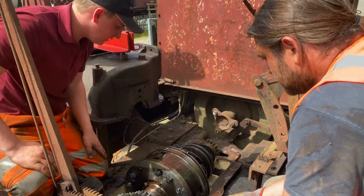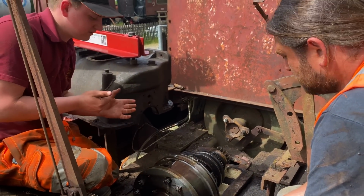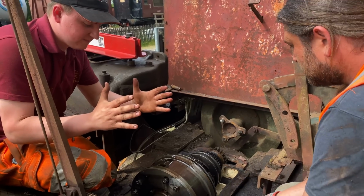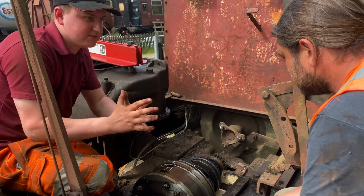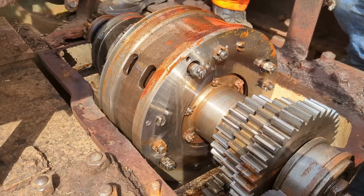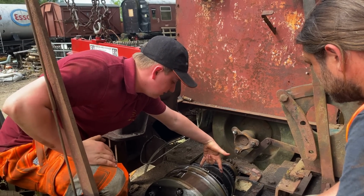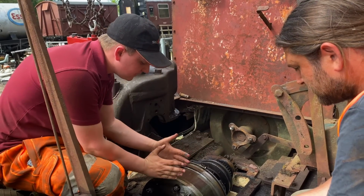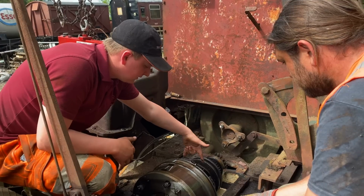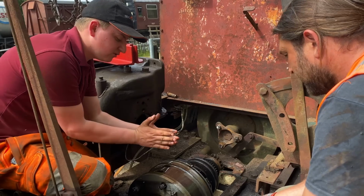You think of a modern automatic car, or a forklift, you've got clutch packs. So what happens is you've got steel, friction material, steel, multiple wet pack plates, and when you apply oil pressure to the pack, it grabs it and that grabs a gear. This is the same concept, but you're using mechanical leverage to physically push this, these are your selectors, into a direction, and it will either grab first, second or third clutch. So you've got first and second on one and third on the other one. So you've got 3 clutches in there and 2 steel plates between them.